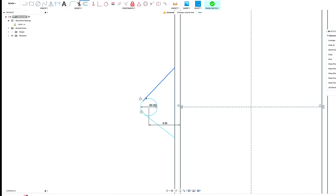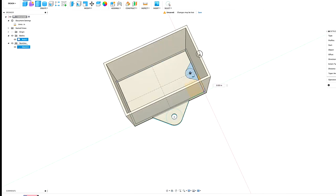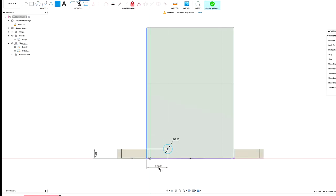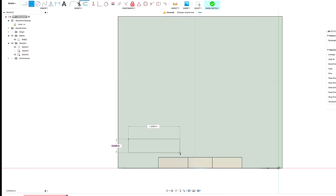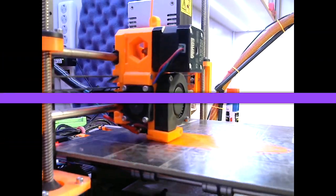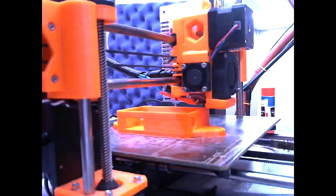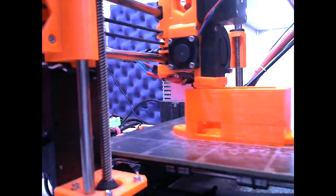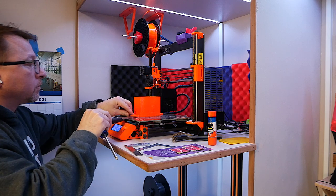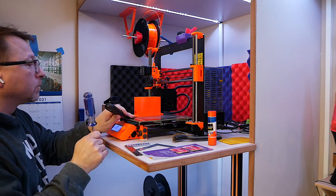The design is a relatively simple rectangle with some tabs on the side that I could use to mount the box to the wall, and some mounting holes on the top where you screw in the receptacle. The advantage here is that I could customize the holes for the antenna, for the power outlet, and for the programming port — so they were exactly where they needed to be when I finally printed the box. This is my Prusa going to town, printing it in Prusa Orange PETG, which is my new favorite filament.